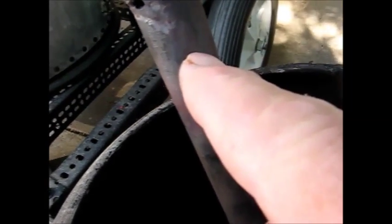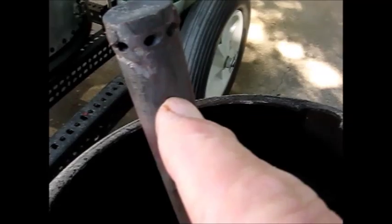What I plan to do is drill two more rows of these same holes in the pipe so that I get a larger surface area and maybe a larger burn area out of this. It increases the airflow and decreases the restriction of airflow, which will probably help the gasifier.